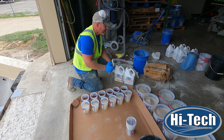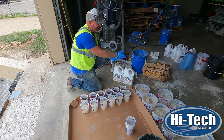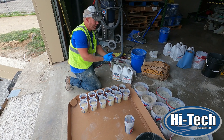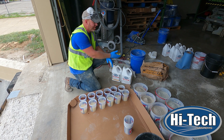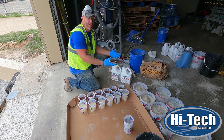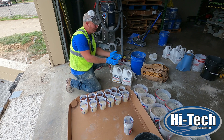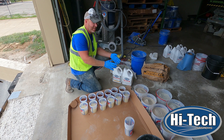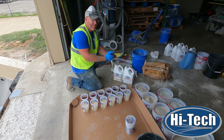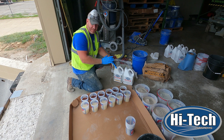This is Quikrete all-purpose sand mixed with Portland cement — you can pick it up at Home Depot, Lowe's, or similar stores. Silica sand will never mimic the look of concrete, which is one issue; I prefer all-purpose sand, which is typically mined locally and will mimic the concrete in the area you're repairing. There are many ways to combine sands and cements with TX3 to get a product that cures much faster than concrete, is more impact resistant, has slightly more elongation, and provides a very durable wear surface that will last for years.